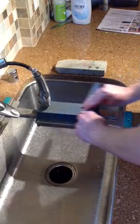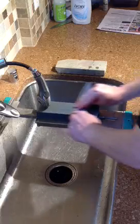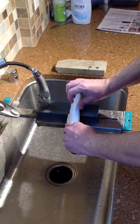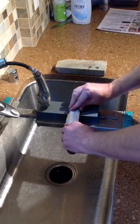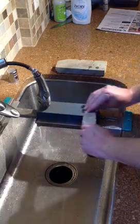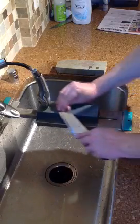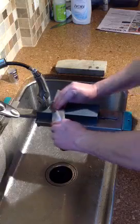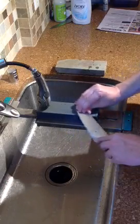I've got my fingertips right over the edge. It's probably a good idea not to really lay them on the stone because you'll grind your fingertips. I've actually had people email me saying they got a bloody finger from this. I don't mean for you to actually push down against it and grind your fingers — just hover over the stone. If you go up or down a little bit, it'll touch your fingertips and help guide you back to the proper angle. After a little practice, you'll have muscle memory about how to do this, like riding a bike, and you won't really need that. But I've gotten the habit of doing it, so I keep my fingers right on there.